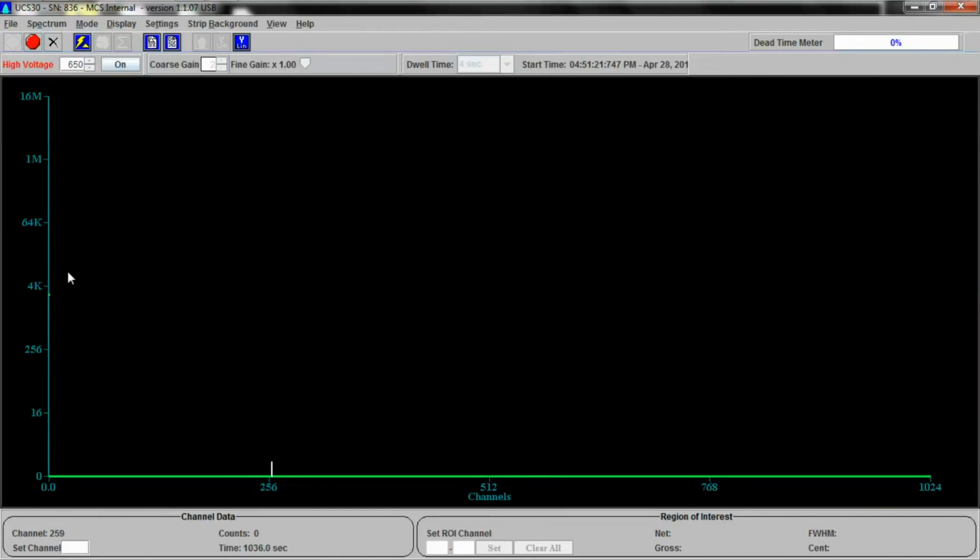And let's start it. I don't know if you can see that or not. Let's zoom in. Okay, we're zoomed in. Now, if you see zoomed in, this is filling up pretty quickly. And if you were to take the maximum range here, in this case 18,933 counts, 19,000 counts, whatever, divided by the seconds, in this case 4 seconds, you know how many counts per second you are getting. Now watch what happens when I move the source away from the actual detector by double the distance. Alright, now it's double the distance away. Let's see what it does.